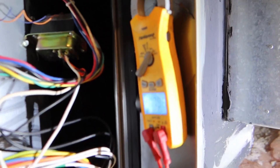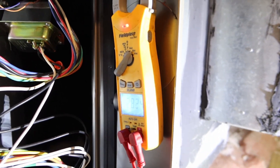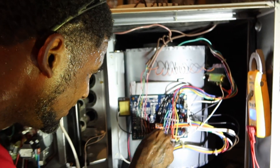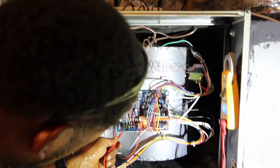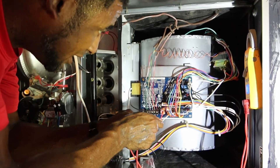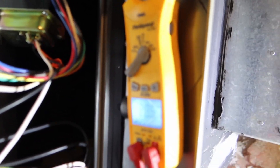See, I got 28 volts on the meter. Let me put it back right here — I got 28 volts. So I know I got 24 volts coming from my transformer. I'm going to go right here again, coming in on red — see what I get. We do got 24 volts right there.